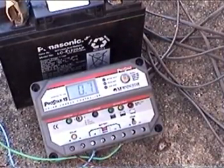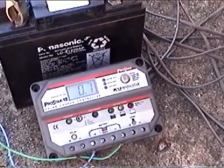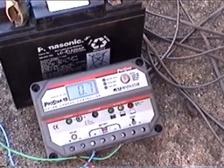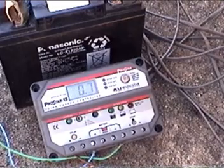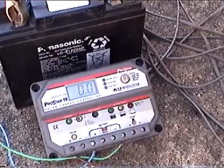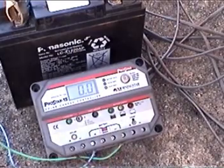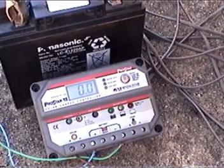It's now 48 hours since we finished mowing and put the battery on the solar panel charger. You can tell it's up to 14 volts now, and it's giving us 0.7 amps from the 45 watt Harbor Freight solar panel array. Yesterday I was getting 1.2 amps — that's the maximum these panels put out, even though Harbor Freight says they're supposed to put out 3 amps. Yesterday the charger was in full absorption mode, and now we're in pulse modulation charging where it's pulsing the current in. I should have about two more days before the battery is fully charged.